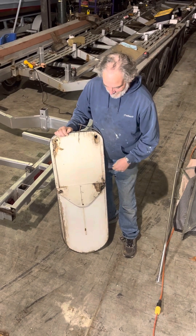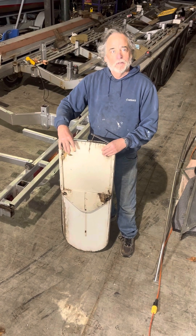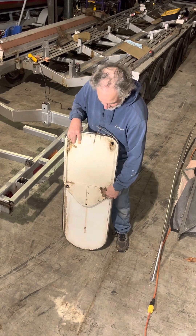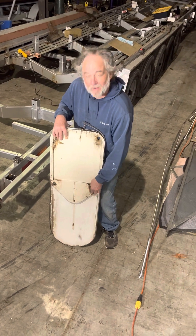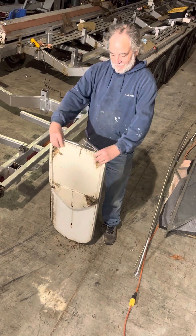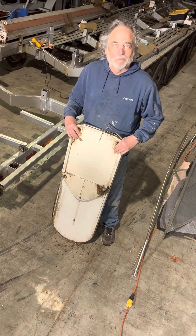This is the bottom of the plank, and it was secured to the deck — just flat from here, plywood right to the deck right here, and then a piece of plywood holding it. Any water that got on here was just going to infiltrate back here and cause all of this rot. So we'll try to do something to minimize that when we replace it.